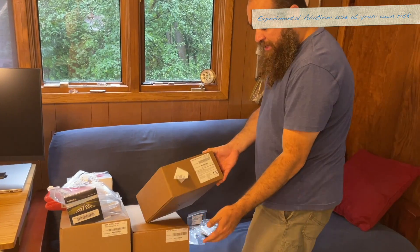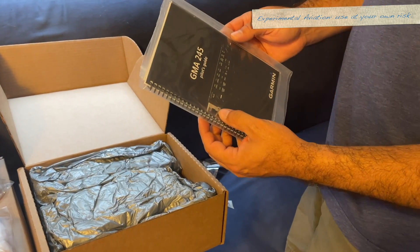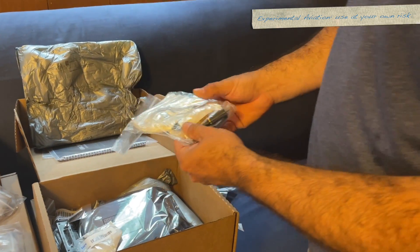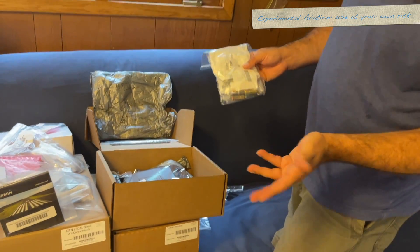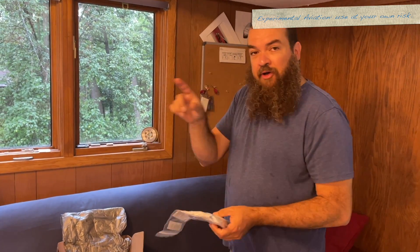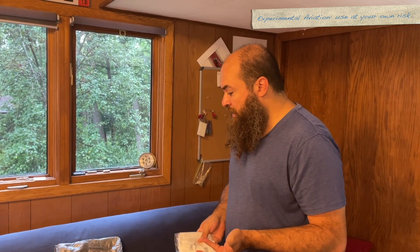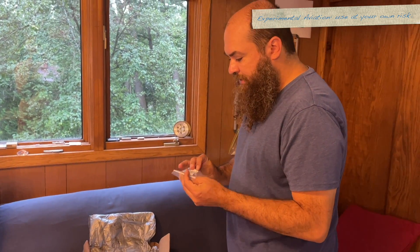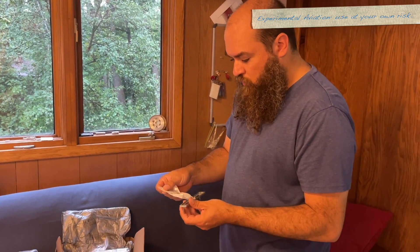Let's do this one first — GMA-245 audio panel. This is the standard Garmin experimental audio panel. There is a remote version as well. We really struggled to decide if we were going to go remote or not because I wanted the extra panel space. But I found that you can configure your G3X system to act like it's remote and put all the buttons on the screen. I did a few flights with it acting as remote and found I really missed having the buttons and knobs. So we decided we're going to sacrifice some of the panel space and do a local audio panel instead of a remote audio panel.